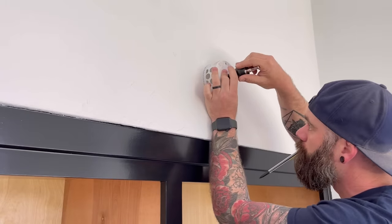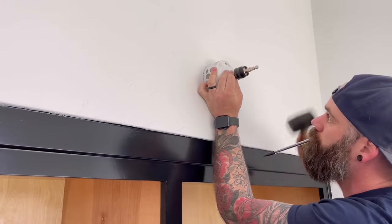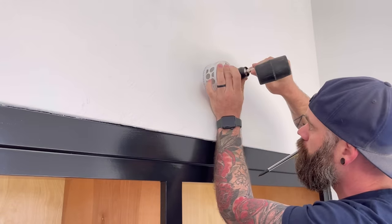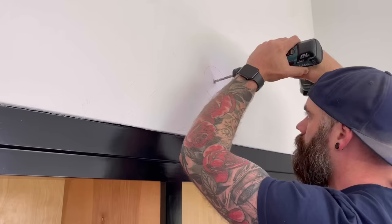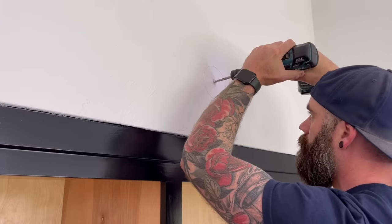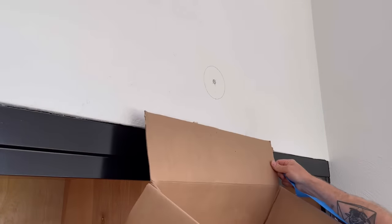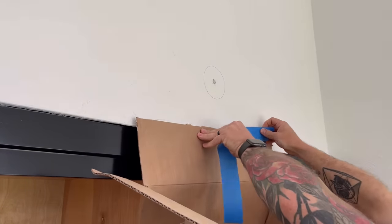In the meantime, I wanted to get my lights figured out above the cabinets. If you remember from the previous video, in this little alcove there was already some can lighting that we covered up with our new cabinetry. So I wanted to rewire those can lights and install some gooseneck lights that hung out over the new built-in. First I had to drill some holes in the drywall to install my little electrical boxes.